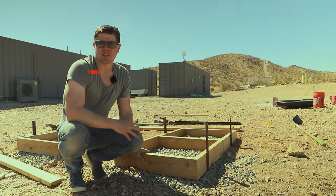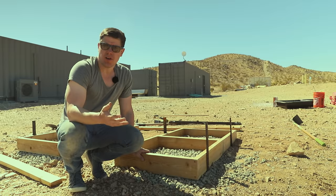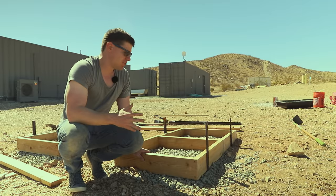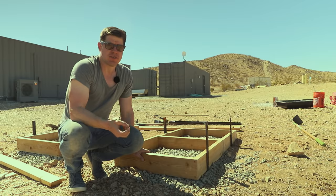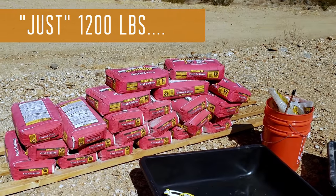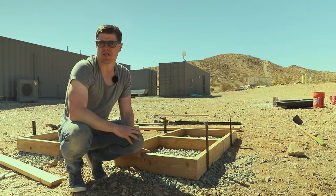I'm building this ping-pong table out at Benuetus Container House, which is right behind me. The soil at the build site isn't very sturdy, and it's definitely not level ground. So I've built some 2x6 forms to pour concrete slabs using rapid-setting concrete, which will provide a nice level surface for the ping-pong table to rest on.